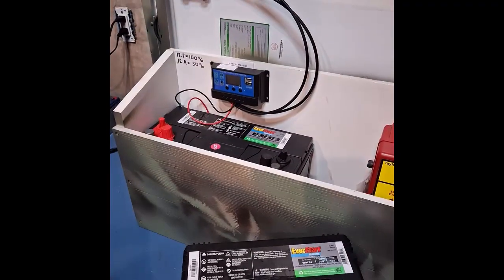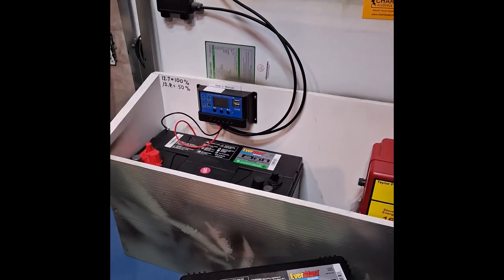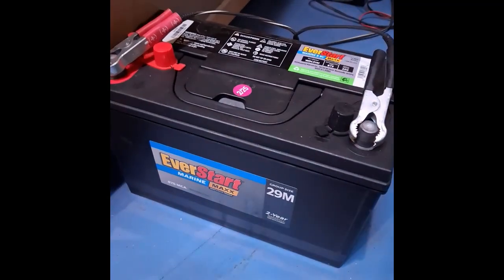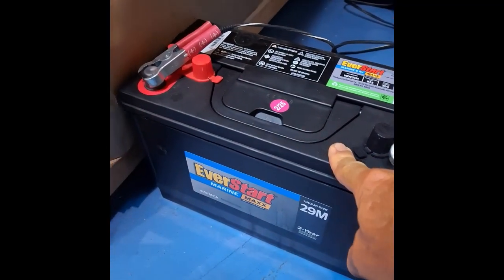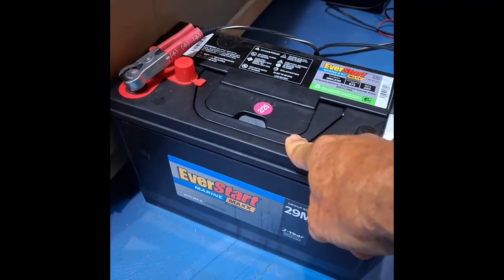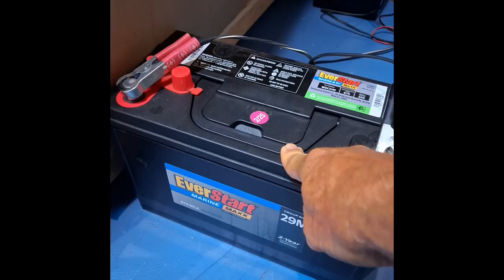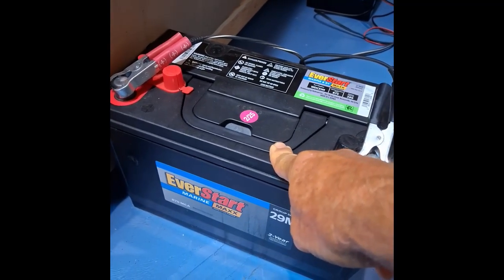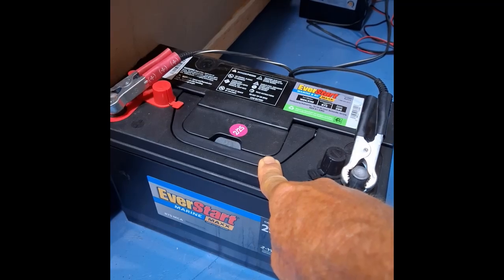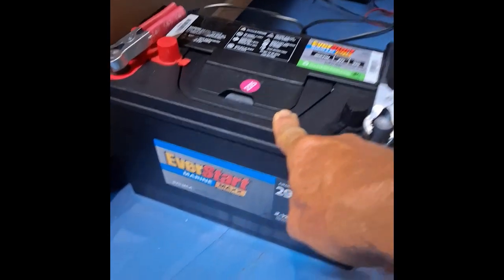And you would follow the same procedure in changing your battery by covering the solar panel as with the smaller battery. One thing to add when buying a new battery is when you go into the store to get a new battery, take the old one with you, because if you don't, they'll charge you a core charge of $12 to $18. And you can also, if you're unsure of what size you have, match the size to the new battery.